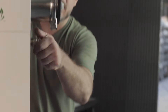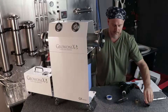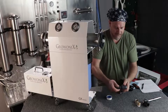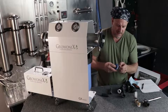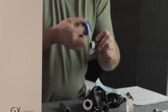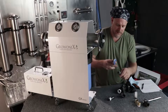First thing I'm going to do is take off the garden hose brass fittings because we're not going to use them. Then we're going to put some Teflon on the Schedule 80. Now you really should follow standard plumbing codes. If this is a little unfamiliar to you, definitely hire a plumber — this is stuff you don't want to screw around with. It's got to be done right, but it's also not that difficult either. I'm going to wrap about five wraps or so of Teflon on these nipples.